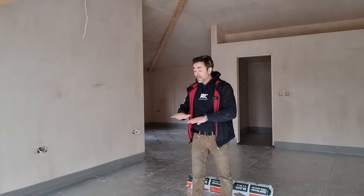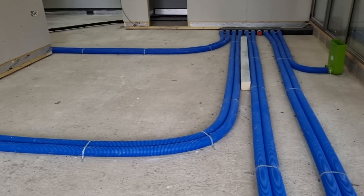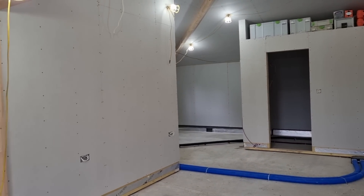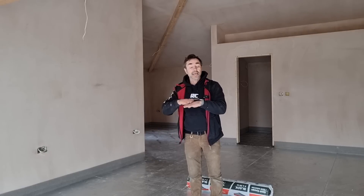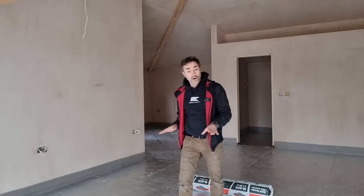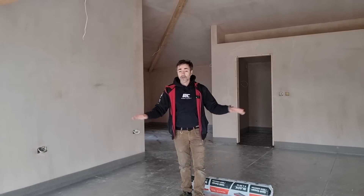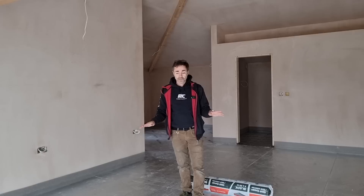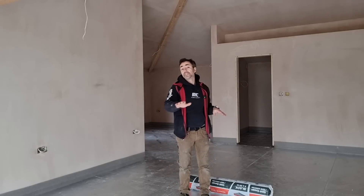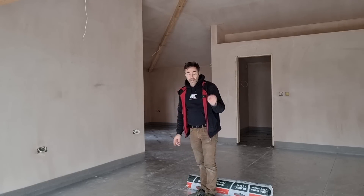This is what it looks like — an insulated slab after all the work is done. We've done all the insulation: MVHR pipes underneath in the first 100mm layer, then 25mm of PIR over the top of those 75mm pipes to bring us up to the 100mm level, then a metal plate all over the pipes in that first layer. The final layer of 25mm PIR goes all the way over — everything is really nice, supported and rigid. We've also put our expansion strips around for the screed.